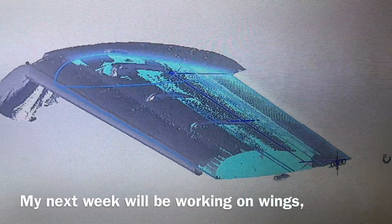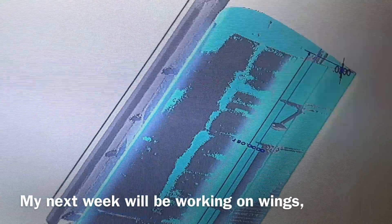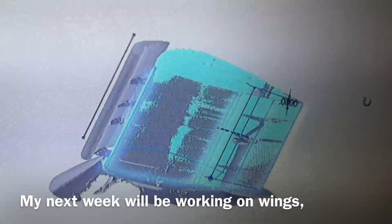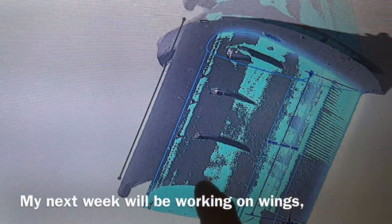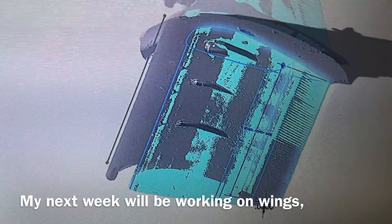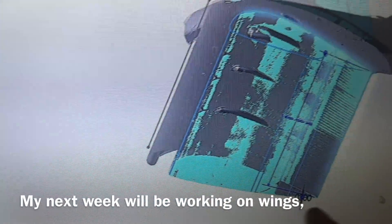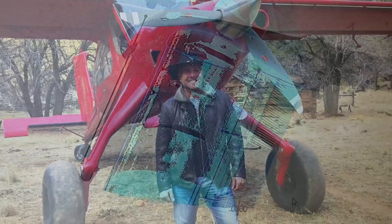The blue is our computerized new replica of the wing. If you rotate it around you can see the original flaps, and you can see this stripe is one of the rivet joints. You can see the top of the wing, the areas between the ribs and where the metal has flexed. It's really amazing - we're within a few thousandths replicating the wing off a 3D scan. You can even see the leading edge slat drawn in there. But now we're going to draw a new shape of the wing and move the leading edge slat forward. It takes a lot more time than anyone would think, but we're getting a perfect replica of the wing.